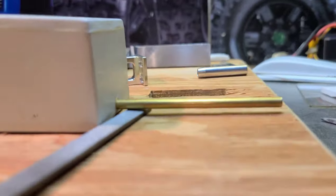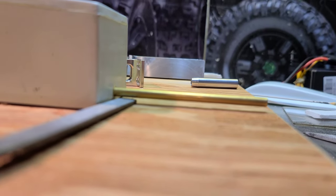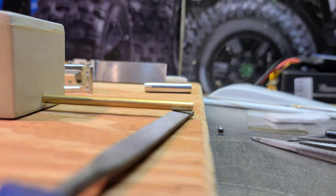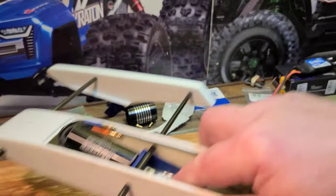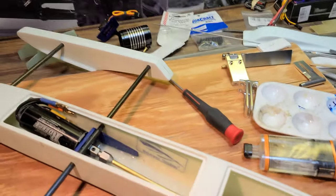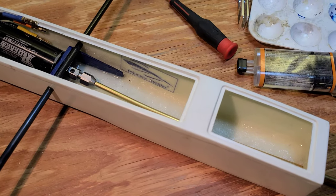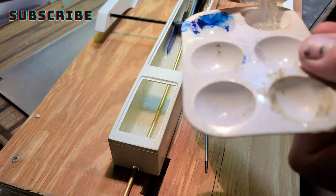I want to start with a neutral position. It's completely neutral — you can see it's not touching my ruler and it looks about the same height all the way down. I think she's ready to be epoxied in. We're going to tack it in place with five-minute epoxy, and tomorrow I'll probably do the 24-hour epoxy.